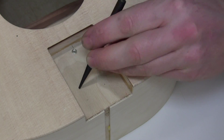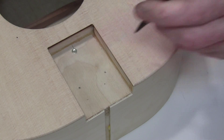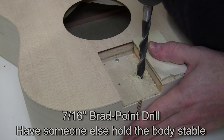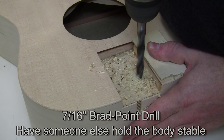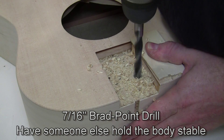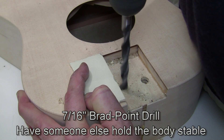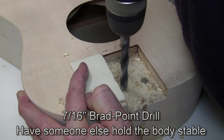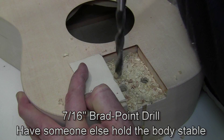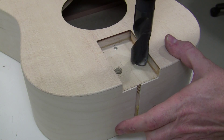You can see the little dents that the transfer punches make. Take those dents and make them a little more distinct with a center punch. Now take a 7/16ths brad point drill — it does need to be a brad point. This is a pretty serious drill for a hand drill, so hold it close to your body against your rib cage for much better control. Use a piece of wood to protect the top in case it goes down too quickly. You can use medium or high speed, and use a file or whatever you like to get rid of the burrs on the hole.